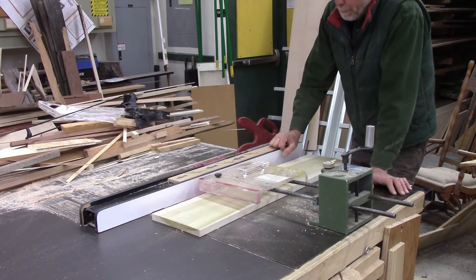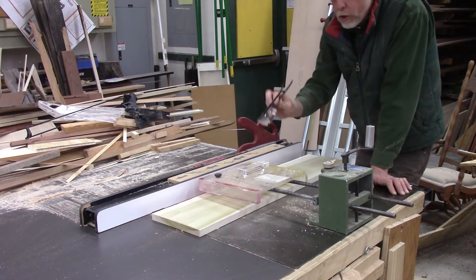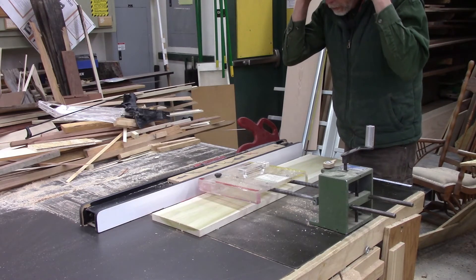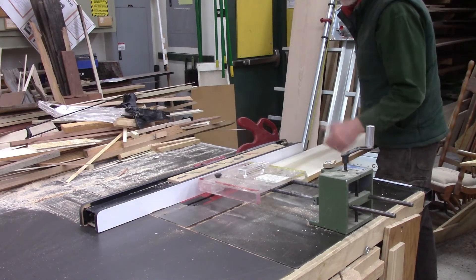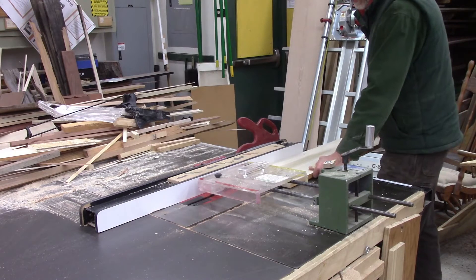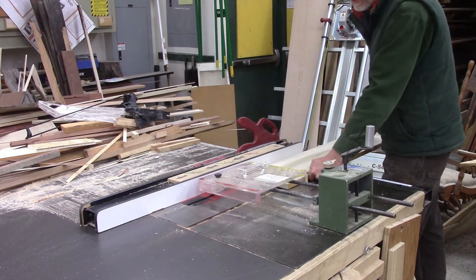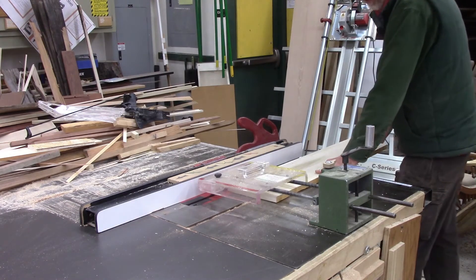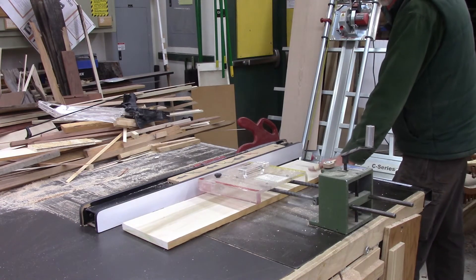Regardless of all my setup, I always want to make sure I have my safety glasses on when using these power tools. Now when I make my cut on the table saw I'm going to do seven steps. I start with my fist halfway between the guard and the front of the table, pushed tight up against the fence. I start pushing, and when I do this my left foot is forward. When the board gets to the table I stop.